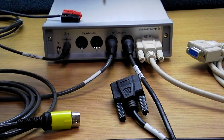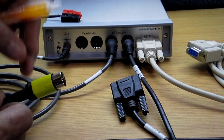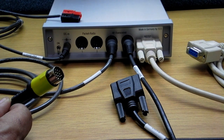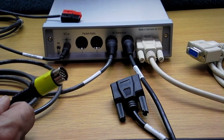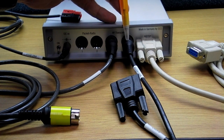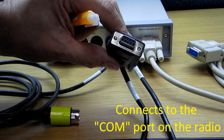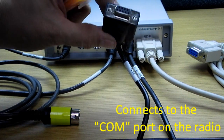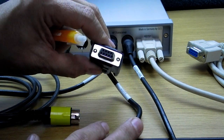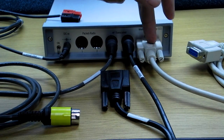The next one is HF audio — this cable comes out to our standard 13-pin cable, transferring audio in and out to the radio and push-to-talk. This connects to the TS-2000. The next cable is the unique one on this unit: a 9-pin sub-D serial cable that also connects to the back of the radio. This lets the unit control the radio and change frequencies automatically, which is extremely convenient. This cable connects to the TS-2000's serial port.